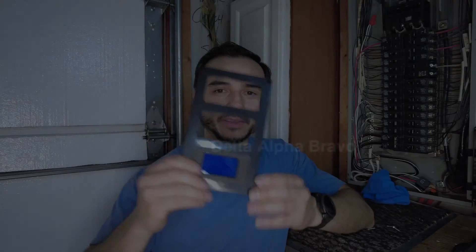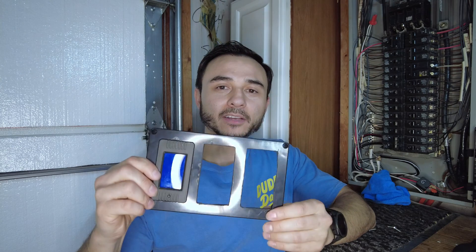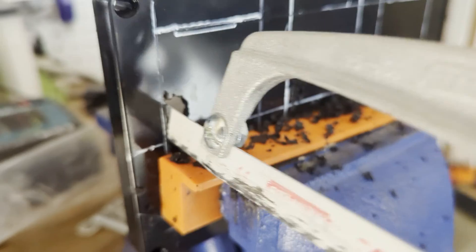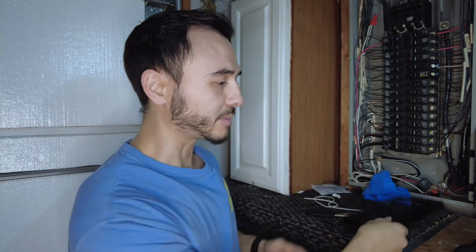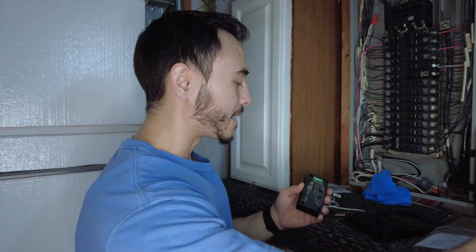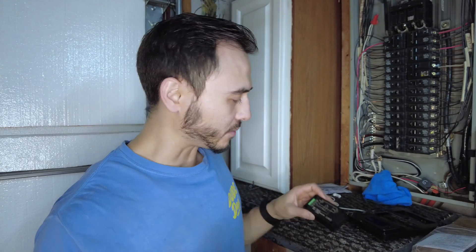I have the frame here — the cover of a junction box — and it's got holes for three of these. One is already in here. This is going to be used for my generator to find out how much power I'm drawing when I have the circuit breaker turned on. When you buy these — link in the description — make sure you get one that has a current transformer that can open and snap closed around a wire like this one.